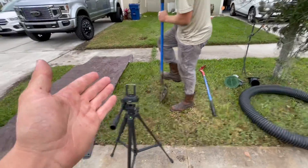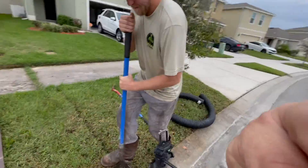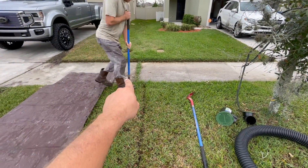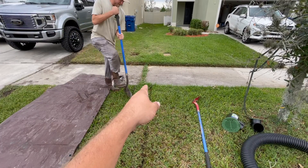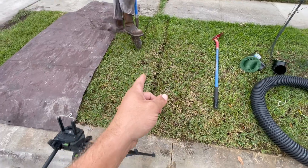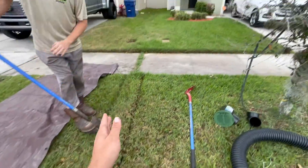This is your elbow, this is your drain. We're going to do it the right way. He's chopping sod — this video is going to be over pretty quick. Always start at the lowest point where the water gathers. You can see the growth between the sidewalk right there — it's coming right between these two houses. Chop the sod down, remove it to one side, take a trenching shovel, dig down, take the dirt out, catch basin, pipe, pop-up, go home, eat a delicious dinner.